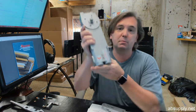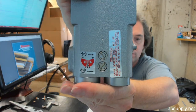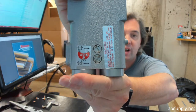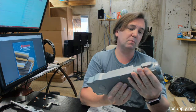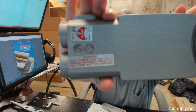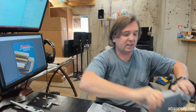There are flat head adjustment valves for closing and latching speeds, also known as the sweep and latch valves. The valve at the top, even though a number 2 is stamped there — it may simply mean there are 2 valves on this closer. These are not staked valves, and you are not to exceed 2 full turns in either direction, otherwise you will compromise the integrity of the door closer.